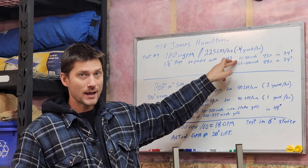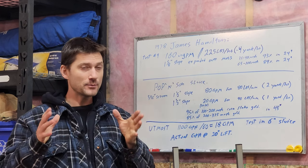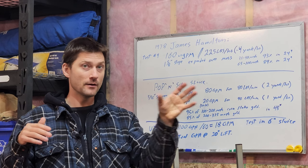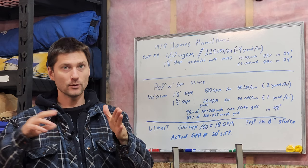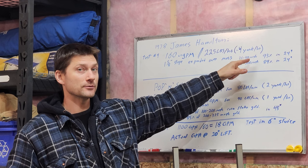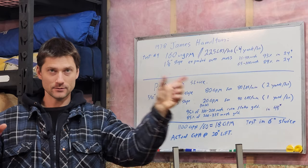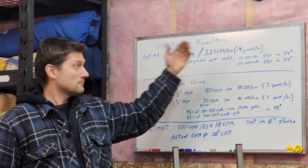The 35 to 48 mesh gold — about 50% of Alberta gold depending on location, roughly half above 50 mesh between that 30 to 50 mesh range and the other half below 50 mesh — they got a 93% capture rate in the first 24-inch section. They had a bunch of 24-inch sections with slick plates in between to see what percentage was captured in each section. 93% — not bad.